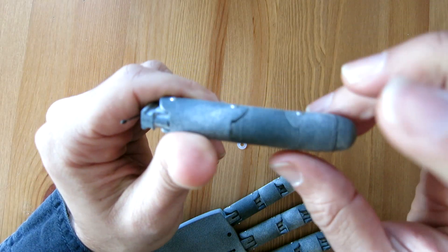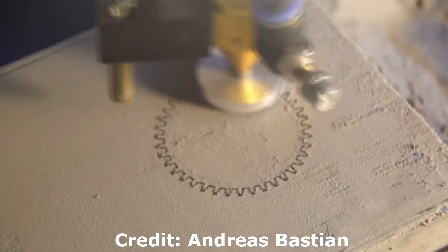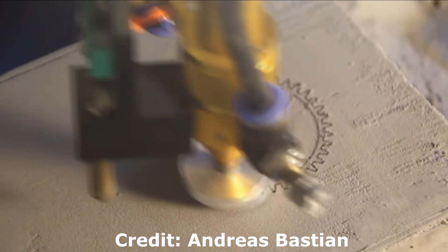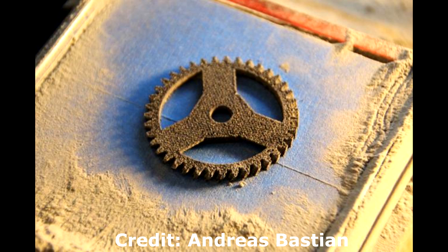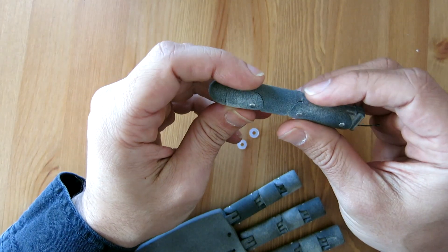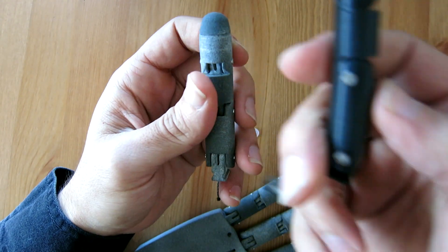In this design I've gone for SLS printing, which is an advanced form of 3D printing. It uses a powder matrix and a laser to sinter together material — a bit different from standard FDM printing which extrudes a molten material layer by layer. This still builds layer by layer but has some benefits: SLS printed parts are more durable generally, made out of a nylon base so they're quite tough, and because there's no support material involved the quality tends to be much higher.